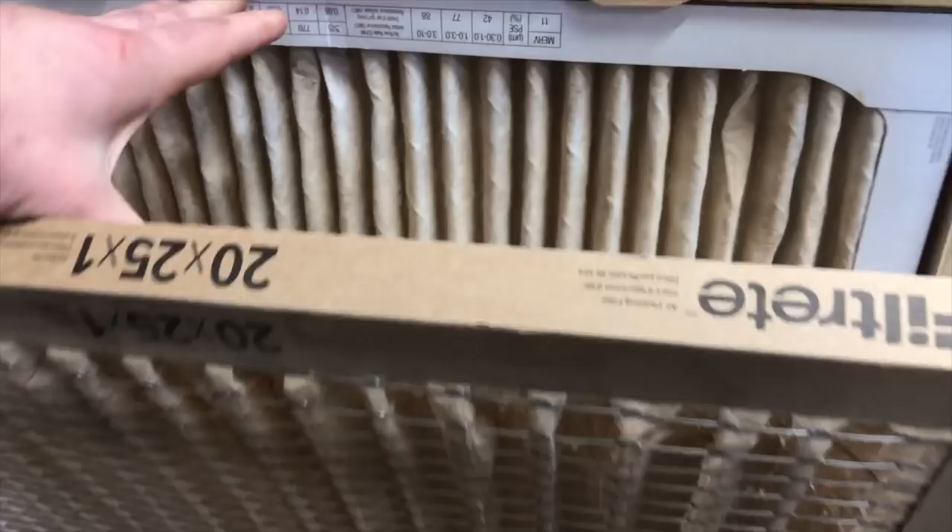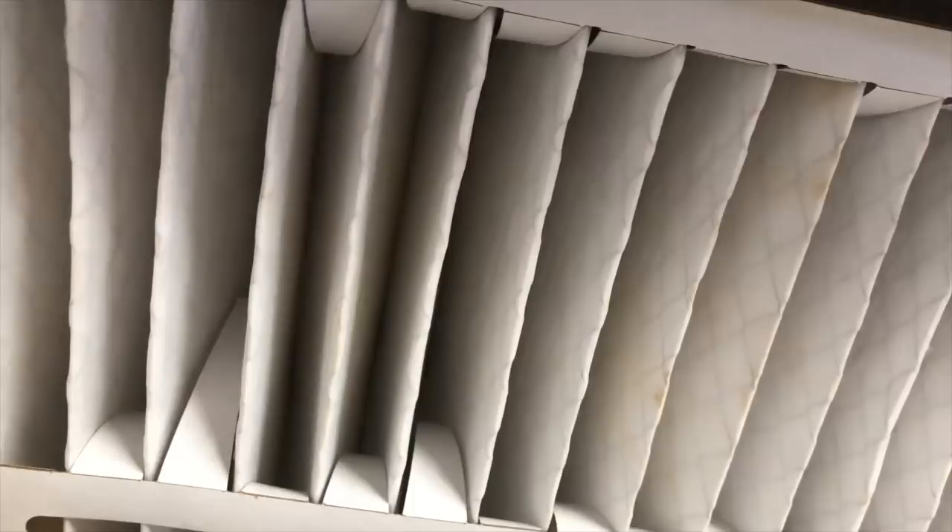The outside filter is a MERV 5, which is basically a throwaway — only costs a few dollars and most of the air passes through. The entire concept is just layering it so the most expensive filter lasts as long as possible, replacing less expensive filters or vacuuming them off to extend the life, saving time before those $25 filters inside have to be replaced. But anyway, that's it. I hope you enjoyed this — thanks for watching and following along. I hope you learned something or are at least entertained. If you want to help support the channel there are links below. Until next time, make time to make something.